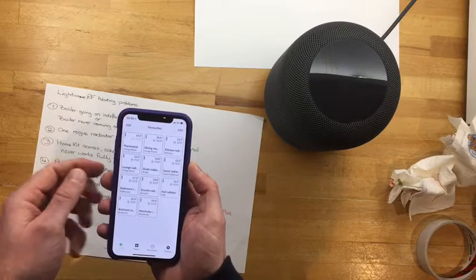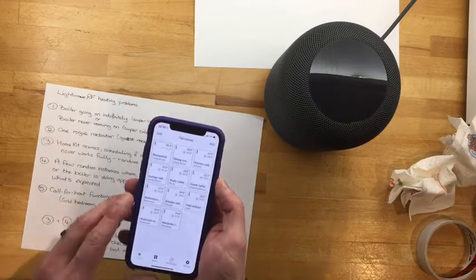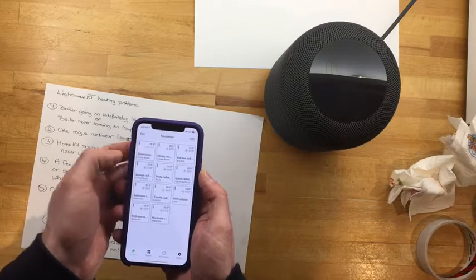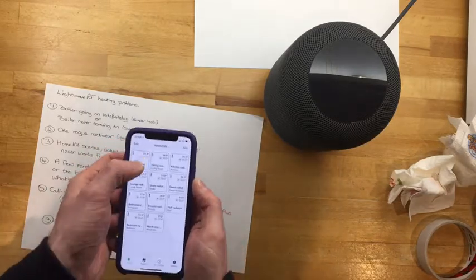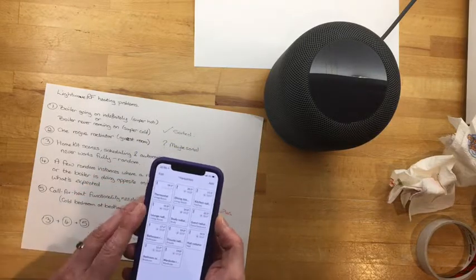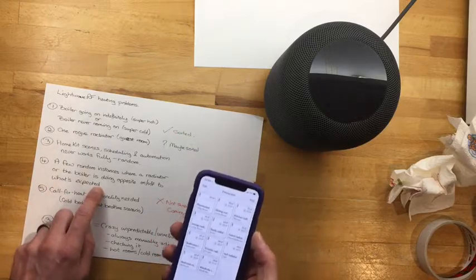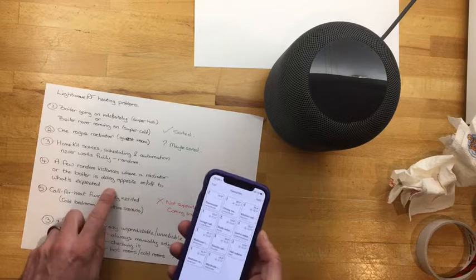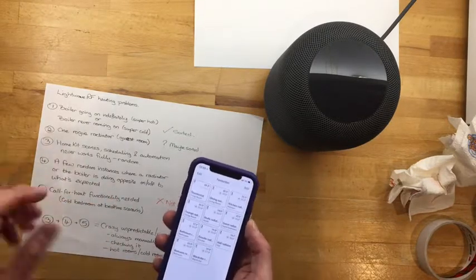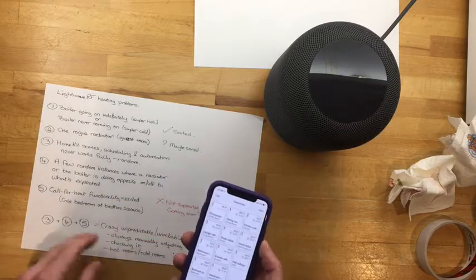There's no reason that room should have got that hot, and I touched the radiator, it was hot. But that's I think number 2, so that one I think is sorted. But clearly that's an example where it's doing the opposite of what I'd expect. When that thermostat got that high to 19 and it's set to 15, it shouldn't still be going, but the boiler was going. So this is number 4. It's not all the time, but there are random times when you think it's doing the complete opposite behaviour to what you expect. You'd imagine maybe within a degree or two, maybe it's got a bit of tolerance, but when it's several degrees out, it should have shut the thermostat, shut the boiler off by that stage, but it didn't.